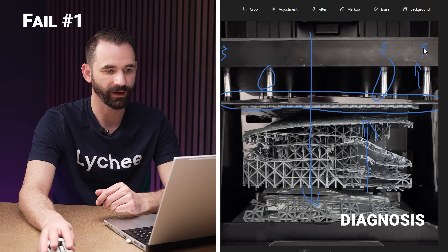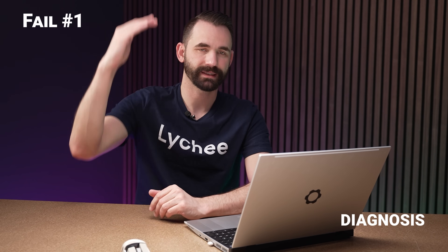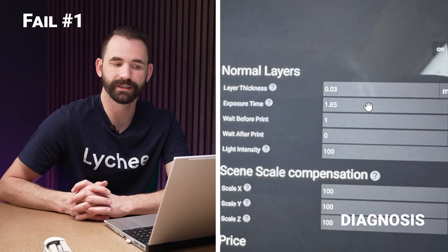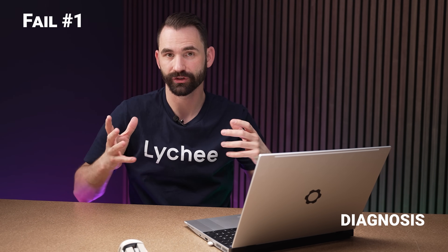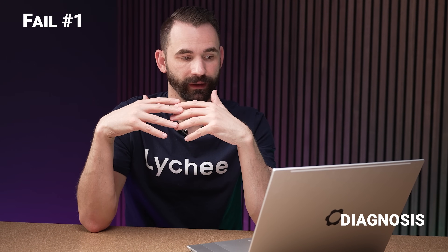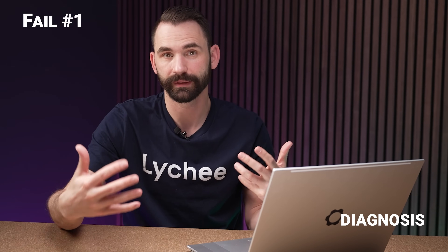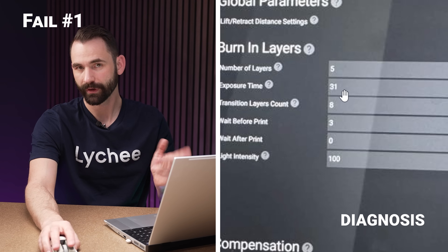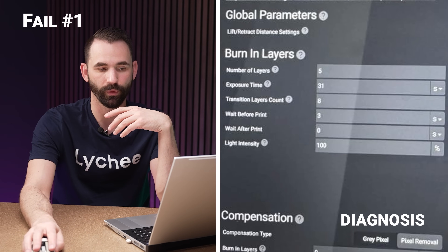The springs will coil up much thinner and the build plate is going to lift up. That matters because as the assembly goes down to the resin and the build plate lifts up, what we have is a layer that's thicker than it's supposed to be. If we look at the settings, these layers are supposed to be 0.03 millimeters thick. But if the build plate is moving up because it's on springs and not fixed to anything solid, it's probably going to be closer to 0.06 or even 0.1 — multiple times thicker than it should be.